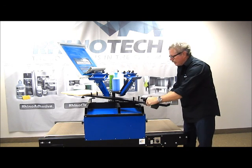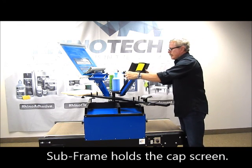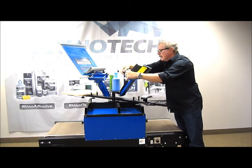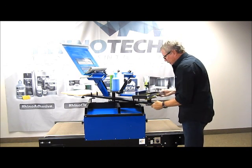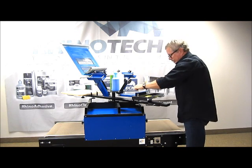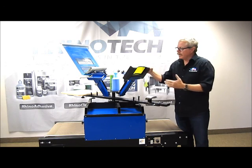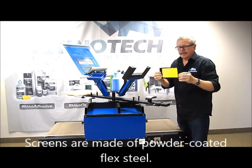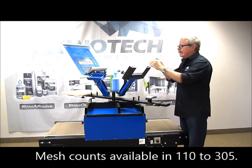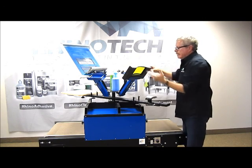Slide this on and I'm just going to snug it temporarily. Then we have our subframe and this is what holds our screen. Get this in place, bring this out, get them lined up and tighten it down. It's that easy, it's that fast. Get yourself one subframe, one screen — which is a flex steel powder coated screen. Then we stretch the fabric on it, the mesh, and that comes anywhere from 110 up to 305. Slide it into the groove, snap it in, lock it, and we're ready to print.